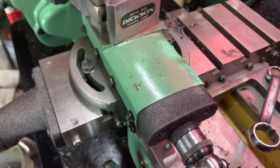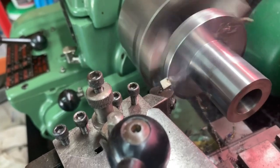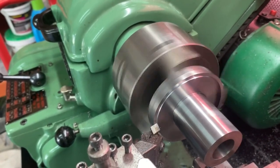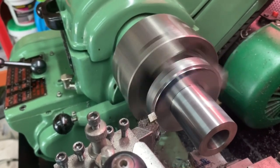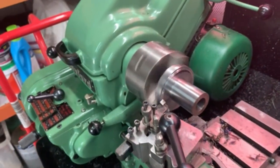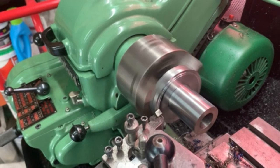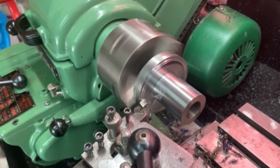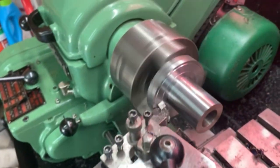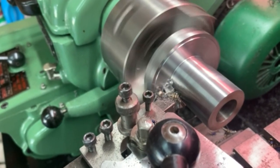Just winding in a little bit more and it's starting to clean up quite nicely. Now when I get to this section I'm going to take a measurement before I go any further — this outer piece has to actually be machined down in size and I need to make sure I'm not taking off too much. I'm glad I did a check — I was actually taking just a tad too much material off. My finish size there is 12mm and it was spot on 12mm. So I'm just taking off material and taking it down, winding this in by hand — I don't have the luxury of a power feed in this direction. I'll just take it down to just fork the shaft slightly.